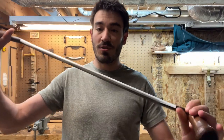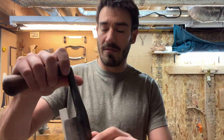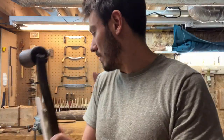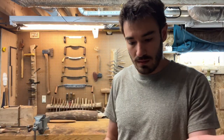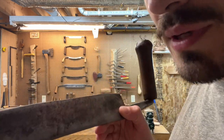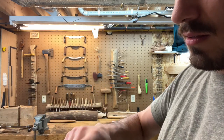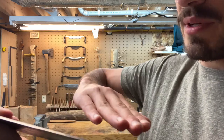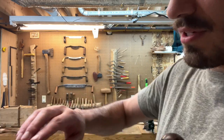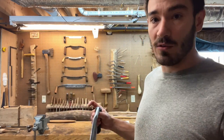Here's a knife I plan on restoring, but I haven't gotten to yet. It's a DR Barton number 16, another timber framing knife. The handles are loose, needs a little work. This is a good example because you can see someone ruined the blade by sharpening it on the backside. Usually you'd only want to sharpen the bevel. You want to keep the bevel as flat as you can and keep the back as flat as you can in cross-section. When the back's been sharpened, it's really hard to guess what angle you need to hold the knife at in order to make the cut.